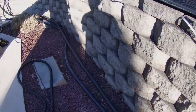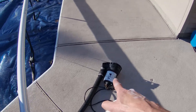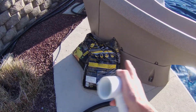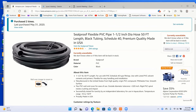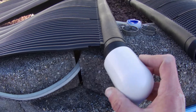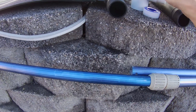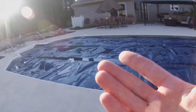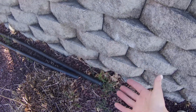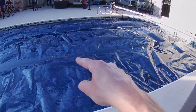I am not going to hook the line up to my pool pump directly. What I use is a separate sump pump that I drop in the water underneath the water slide and just keep all the pipes back there away from the slide. I'll put up on screen what type of pipe that is and where I got it. I'm going to run the pipe up into the inlet — Teflon tape this run right here, screw that on, and run the pipe up through there. Then I can take off this pipe anytime I want to use it for other sump pump purposes, like draining the pond — multiple uses. I'll also sometimes drop the sump pump in the pool on top of the winter cover in winter to drain off any rain.